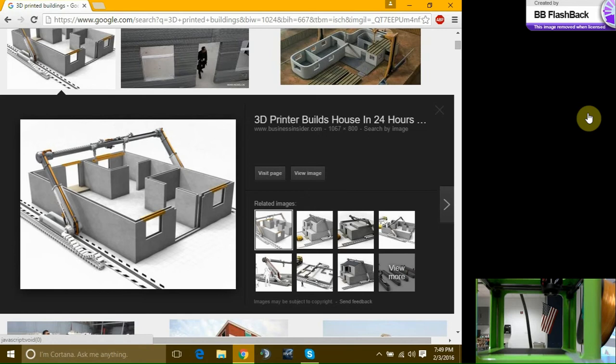I'd rather have my part stationary and have your tool going all over. But when you start introducing your part moving, you have to worry about engineering aspects. The further away from an axle, from a pivot point, you create a larger moment. Correct? A larger moment could equal failure of a part. It could detach from the base. But honestly, you never get to that height with these printers, so it's really not an issue.